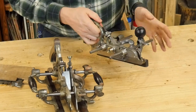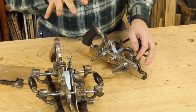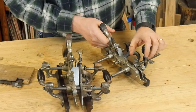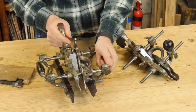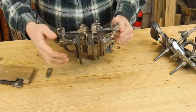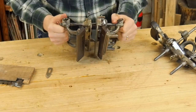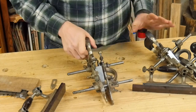That's about it for the 45 — there are a few other bits and bobs you can add, and I could go into it a lot deeper, but for now I'm focusing on the differences between the 45 and the 55. The 55 has several other features. Number one, the most obvious, is that it has a second fence. It doesn't have the front knob, and the second fence gives you much better control over twisting and turning. The other neat thing is that the fences can actually rotate and slide to 45 degrees, which allows you to run up the corner of a beam and put a bead running down it.